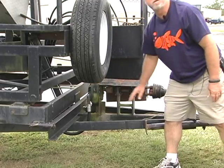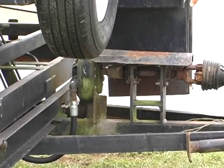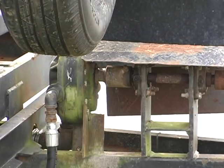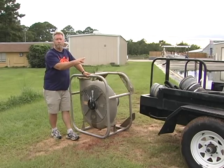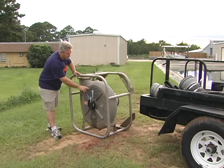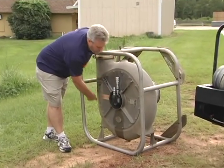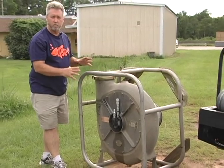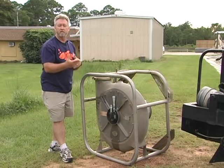This particular fish pump is run by a hydraulic pump. Hydraulic fluid comes to the pump, circulates through these tubes, and is transferred out to the actual fish pump. The hydraulic pump moves the hydraulic fluid through a series of hoses into a second motor, which drives this very large fish pump. The pump moves a lot of water with a very large impeller, so it doesn't impact the animals.